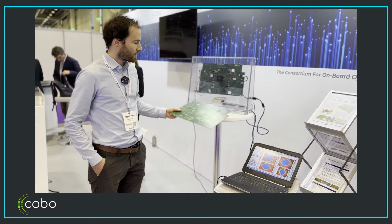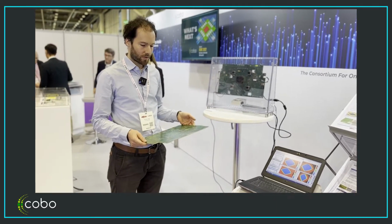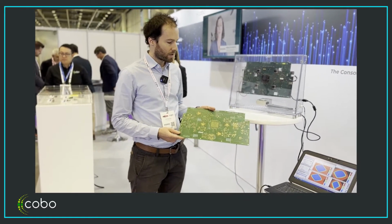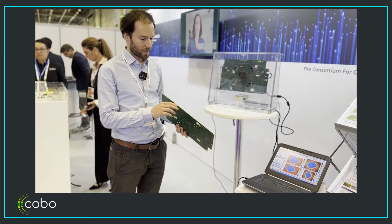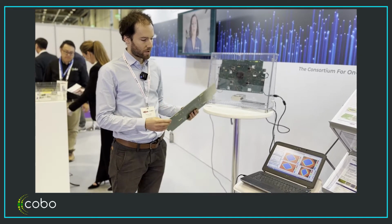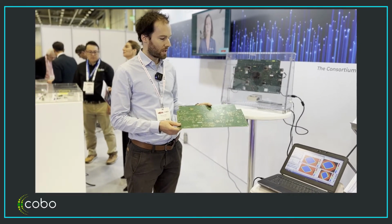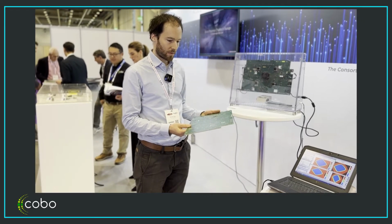At Vario-Optics, what we are developing and producing are electro-optical circuit boards. This is an example of such a hybrid board. It looks like a conventional PCB board, but in fact there is an optical layer laminated right in the middle. So the actual stack up of such a board is 20 electrical layers, and in the very middle there is one optical layer which hosts multi-mode polymer waveguides, which were produced at Vario-Optics.